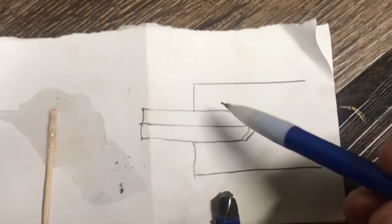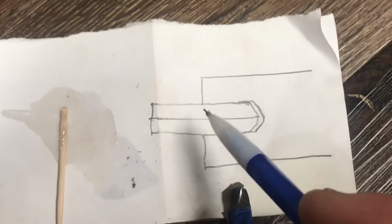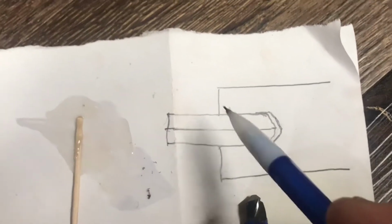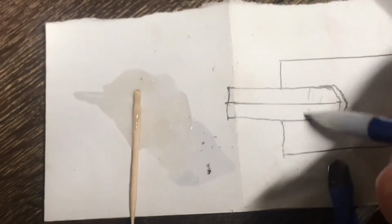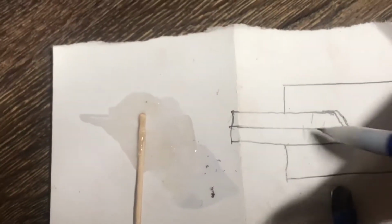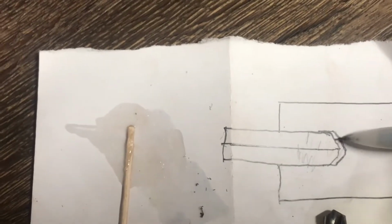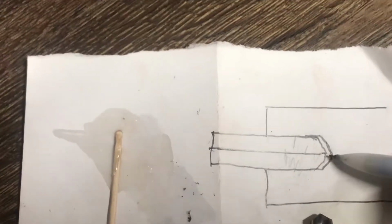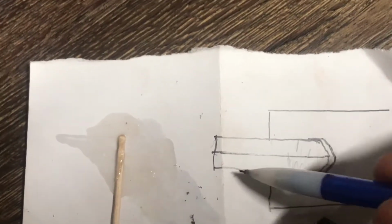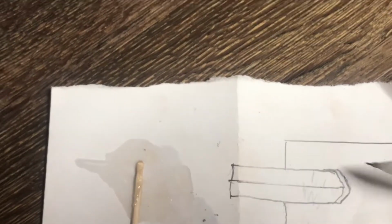I'll drill the mortise first before I drill the airway, because what I want to do is coat the inside with epoxy, and then I have my tenon that has kind of a roughed up exterior surface here so it'll grip. Then I coat this with epoxy. Then when I push this in, I want the epoxy to fill any little voids, so tobacco, liquid, anything doesn't get trapped in here. So when I push this in, it's actually going to push a little bit of epoxy back out this way.